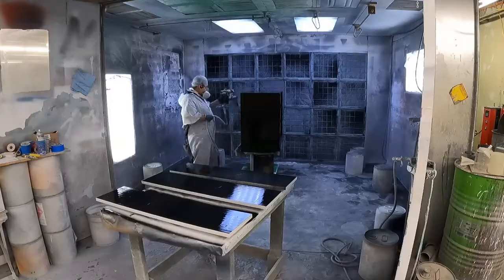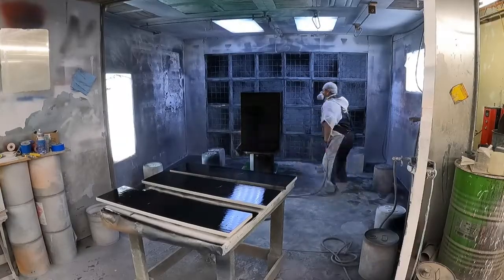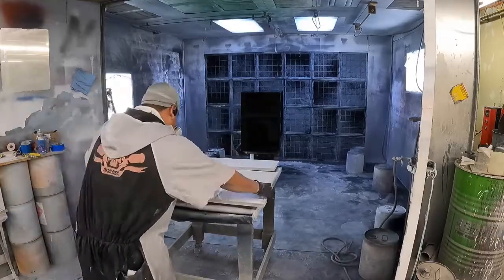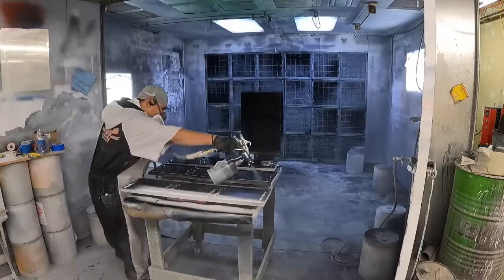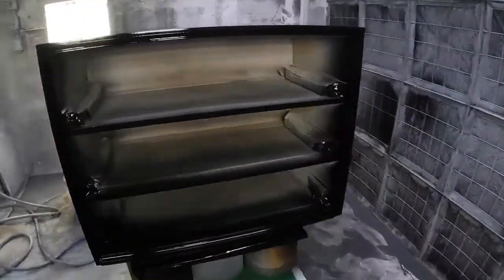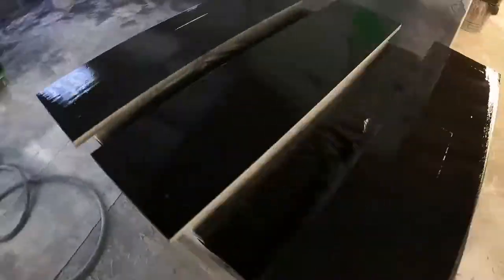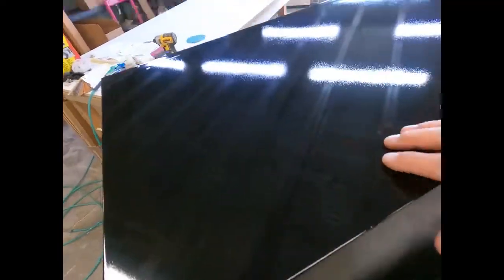Here in the booth, we're going to put 3 coats of pre-catalyzed nitrocellulose lacquer on here, and we'll probably 800 grit sand in between each. This is a very light sanding. We're not looking really for imperfections. We will fill any imperfections that we find, but that's what's going to give us this silky, smooth, buttery finish that people desire. So here I'm looking at this thing and I'm pointing out imperfections, right? And I'm going to go and fill all these things.